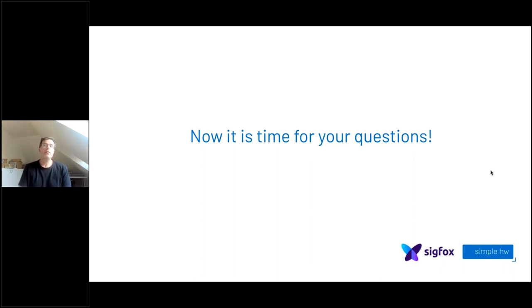You know, with Sigfox, we don't keep a real time clock, so we are not going to achieve millisecond precision. I would say you don't use Sigfox in use cases where you would need millisecond precision, but where 1 or 2 second precision is okay. So you can relate this time to the timestamp of the message, and you can deduce the precise timing from that one.